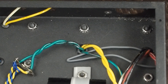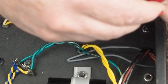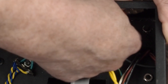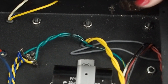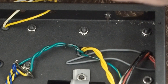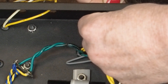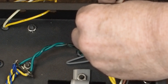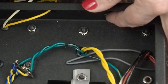The next step is we get one of our little 4-40 allen bolts and bolt it down to the chassis like that with one of these k-nut star washer nuts, to make sure we've got a really good solid ground connection. Then we get a little allen wrench and tighten this up. This should honestly be as tight as you think you can get it. There we go — got a nice solid connection there.